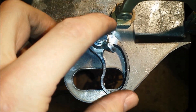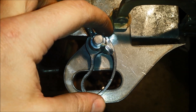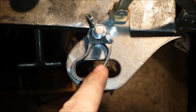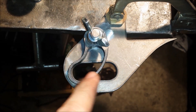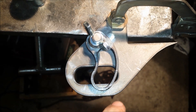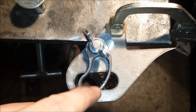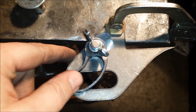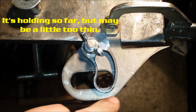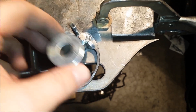Looking at this, you can see I made it adjustable like this. Why didn't I do a straight piece here instead of this curved piece? Because my tests in my CAD software showed me that I'd have to get it to come out beyond the edge right here. I wanted to keep it retained within this edge, so I just put a curve into it and it actually works out well. That allows me to adjust my bushing.